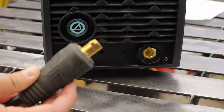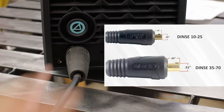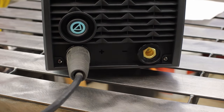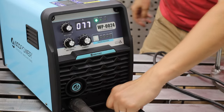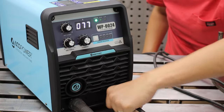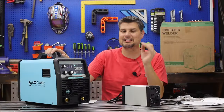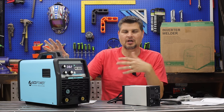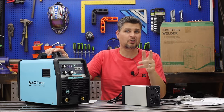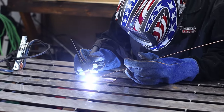You've got two DC terminals — these are 35 to 50 DIN connections, a very common style. I was able to find leads from my other welder and they fit right in with no issues, positive and negative. You can switch back and forth between DCEP or DCEN depending on what rods you're using, or you can get a manual TIG torch and lay down some TIG welds.